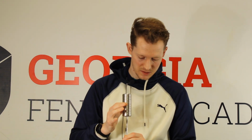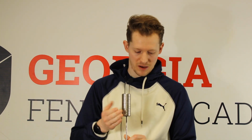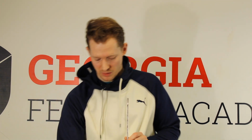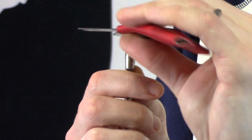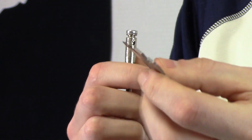So I'll take the weight, set it over, test weights. So you want the pressure spring to be able to push the weight back up so the test box will stop going off. So here we're passing on the weights, and then I'll check my shims again. So this time we can check the big shim. This just simply has to go over the tip, and we've got a little bit of space here, so we're good for the big shim. And then we'll check the small shim again.